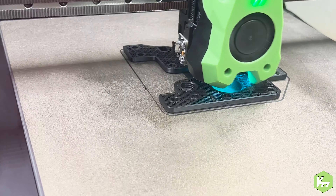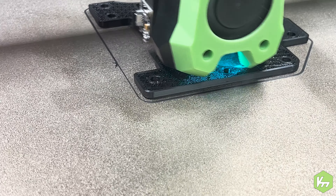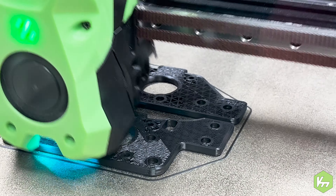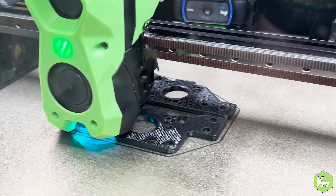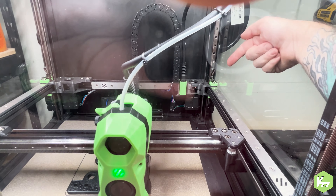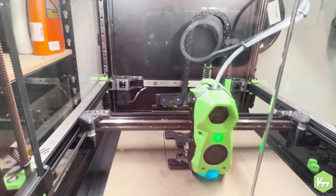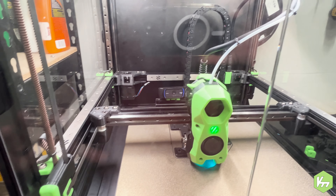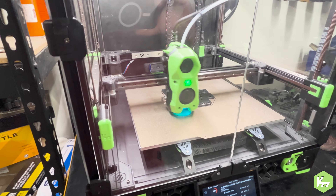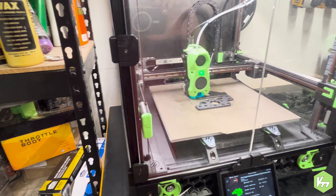As you can see here, we reallocated and repositioned the PG7 connector to make it part of the design of the upper part. On the back side, if I shift, you'll see a pattern there. One of the issues with this design is when your end stop is on there, the other side doesn't have that bulge, which makes things problematic when ensuring your gantry isn't racked. So what I did was make a matching pair, so when the gantry goes all the way back, it's actually square and even.